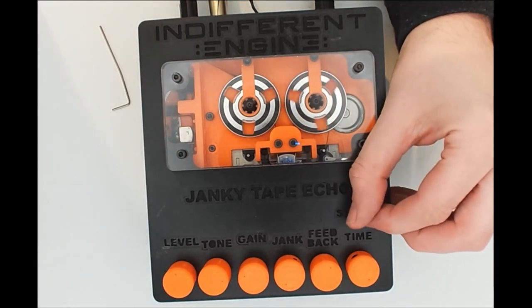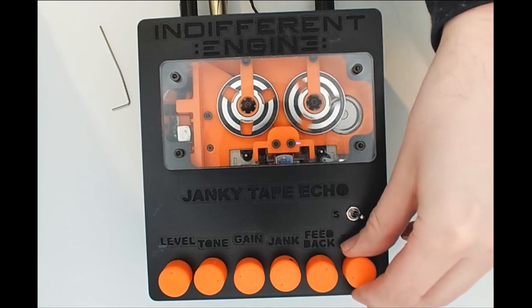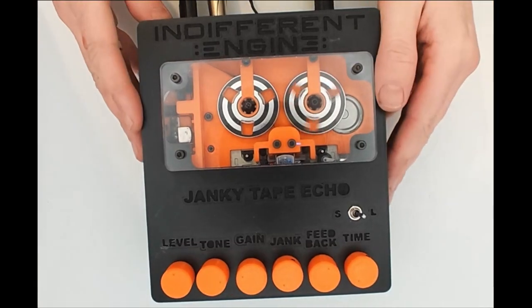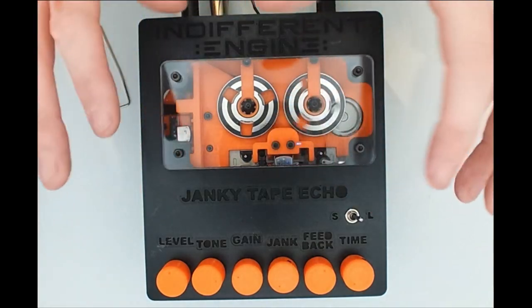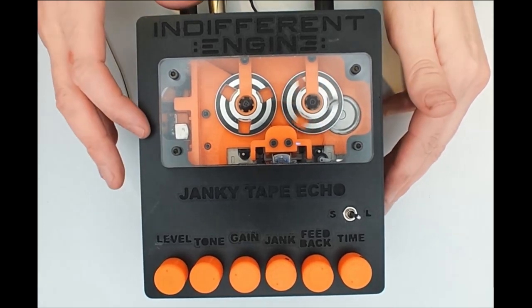You can use the long head to get much longer echoes, but also a medium-tempo echo at a high tape speed, making it very stable. You'll notice that with the motor running quickly, all of that warble is gone — the motor now has much more torque to pull the tape through cleanly and fight the friction between the tape loop and various parts of the machine, most importantly the heads.